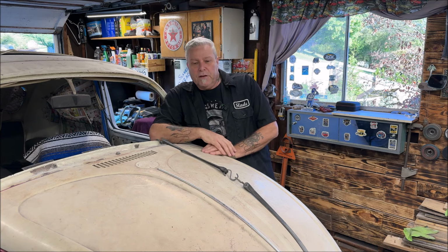I'm considering taking the beam back off. It's easy to do because I've only got 6 bolts holding it on right now before I go much further. I think you're supposed to paint these. Tell me what you think. A lot of the items that we get, like the outside of gas tanks, front beams, you're supposed to wipe them all down and paint them with a protective coat. I think I'm right about that. I'll find out. But if I do, I'll pop it off, paint it, make it pretty, and put it back on. So let's get this remedied quick before we have an issue later.